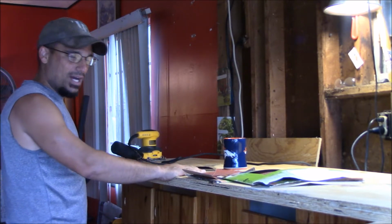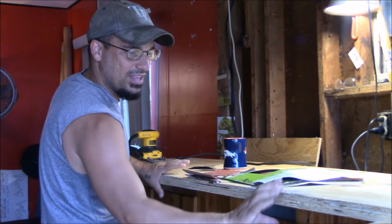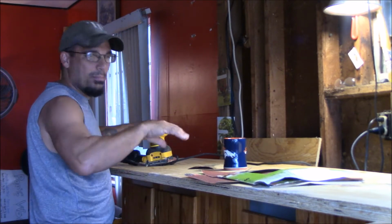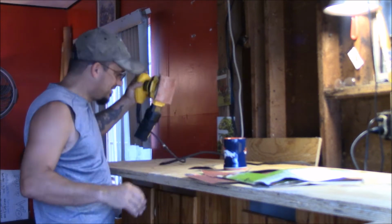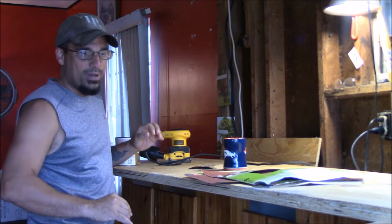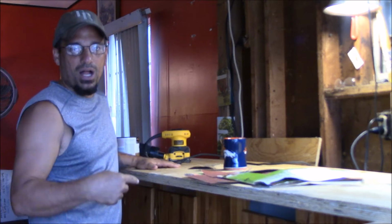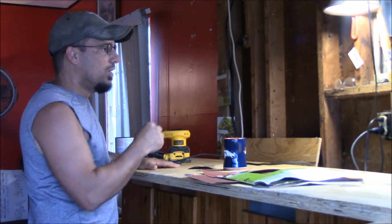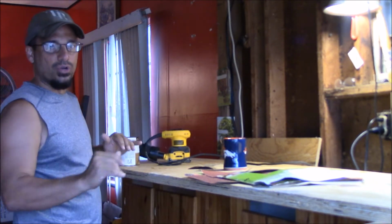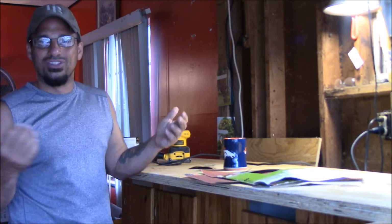So today what I really want to get done is I want to get 1-inch screws at the hardware store. I got to go back to Lowe's and just kind of screw them in from underneath and keep these two clamped down really good. I'm going to sand it with an 80 grit sandpaper real quick on the top. Come back with like a 120 maybe. Get it sanded. After that, I have some leftover wood stain. I'm going to use that, just stain the top, because eventually I'll side dress all the sides. So I'm just worried about doing the top. So sand it, stain it, and then I want to get a couple of coats of polyurethane on today, and then I can do a couple more tomorrow. So I want to get the backs of the cabinets put on, and I want to get it in position today. So today I want to get it pretty much where it's going to be, mounted, stained in polyurethane. And then we can start working on all the extras. So let's do it.